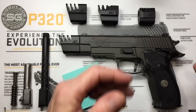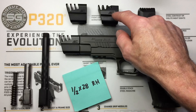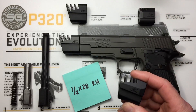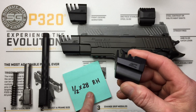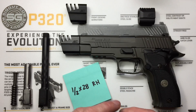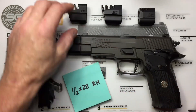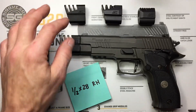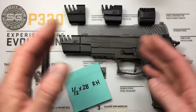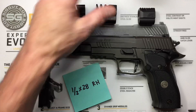We're going to go to our favorite website, order a comp, look in the description, and find out the thread pitch. The example we're using today is the P320. This comp's thread pitch is half by 28 right-hand thread. We want to write that down so we're not confused when we order our barrel — because this pistol here, the 226, uses this comp and the thread pitch on that is 13.5 by 1mm left-hand thread. So you can already see these are not cross-compatible. I cannot take a 320 comp and put it on a 226, or vice versa.